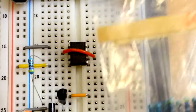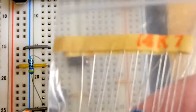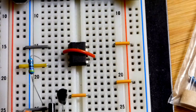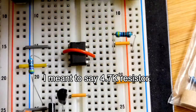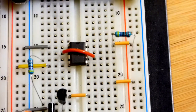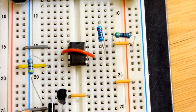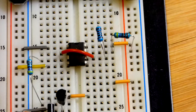Let's add that now. The resistor we're going to use to charge the capacitor is a 4.7 kilohm resistor — 4700 ohms. They used 'k' in place of the decimal point because sometimes it's hard to see decimal points in writing. We have the 4.7k resistor going to pin 7, the discharge pin. The next resistor, which also adds time to the charging — through trial and error I found 1 kilohm works best — goes from pin 7 to pin 6, the discharge pin to the threshold pin. Then I found that a 47 nanofarad capacitor works pretty well — a pretty small value capacitor.